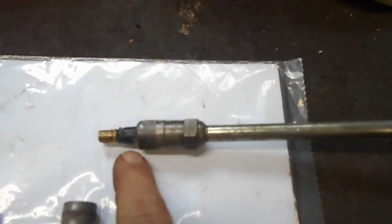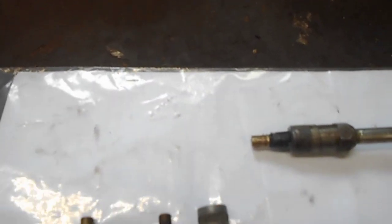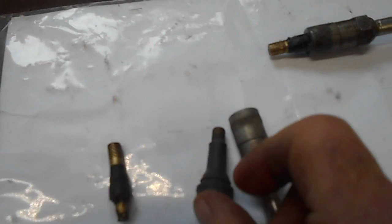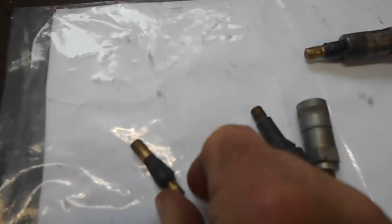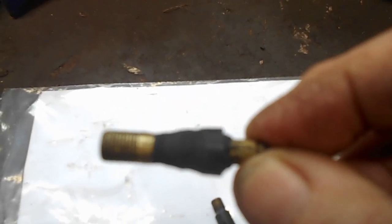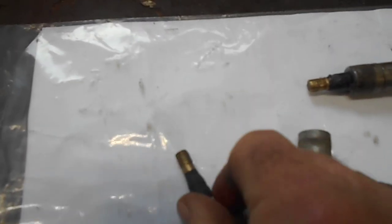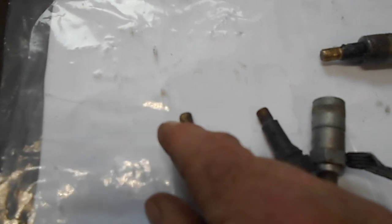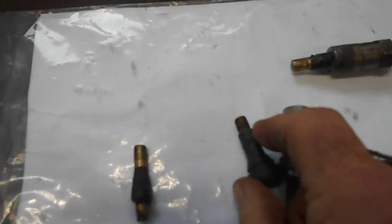I modified the nose of the grease gun with a tire valve stem — a standard used inch-and-a-quarter tire valve stem. I ground off the end of the rubber. This is the best I can show you; don't worry where my fingers are because that was attempt number one and it didn't work. The diameter of the end of this tire valve is decimal .303.